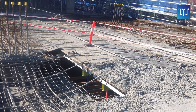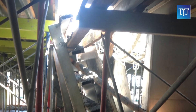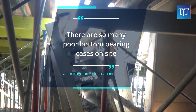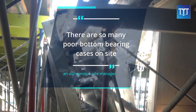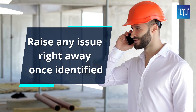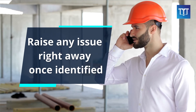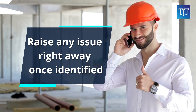So far we've only covered just a few cases where prop bottom bearing could go wrong. On construction sites, there are many other scenarios where props could have poor bearing at the bottom, and it could lead to huge formwork failure. What is important is to raise questions if something doesn't feel right. Otherwise, prop failure leads directly to formwork failure and potentially loss of life — so we need to take it very seriously.